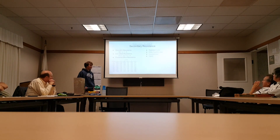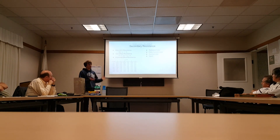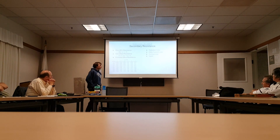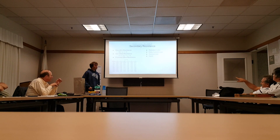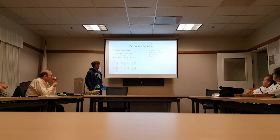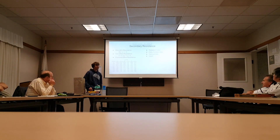Finally, we got the resistance. It seems like resistance should be the easy one, but it's actually the most complicated to figure out. You start with the DC resistance — that one's easy and we measured it; it was quite accurate. But then you have to add in all the AC effects — things like skin effect. What frequency is this? 56 kilohertz. So there is skin effect at 56 kilohertz. The skin depth changes with the square root of frequency.